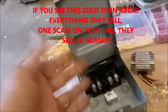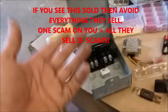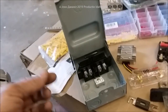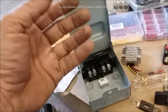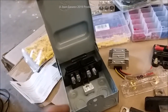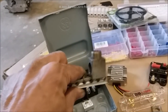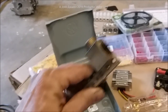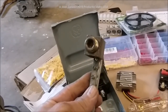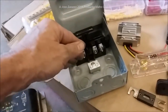If you bought one of these fake solar disconnects and paired it with quality panels — Renogy, Mighty Max, NewPower, or similar — you're in real danger. A customer bought this AC breaker sold as a solar disconnect, ran two-gauge stranded cable into it without a proper pressure cap, and it caught his paneling on fire inside his house. When you're thinking about this setup, understand: this is a scam. This is not a solar disconnect.